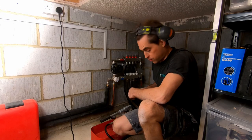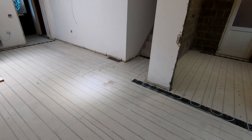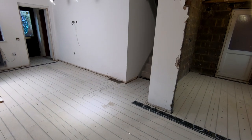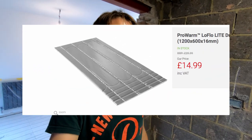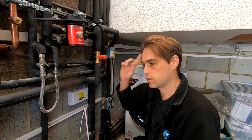With all the pipework connected it's time to pressure test it, and for that I'm going to use my pressure pump. All the pipework is completed and it's ready for finishes — in our case it's going to be tiling. That's why we're using dense panels, because they take tiling much better and it's much safer than using soft polystyrene panels.